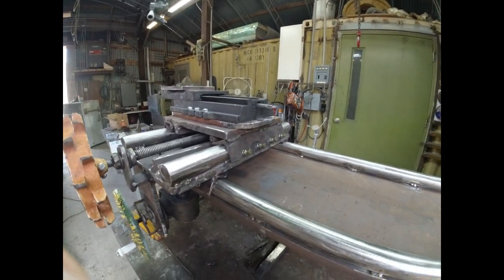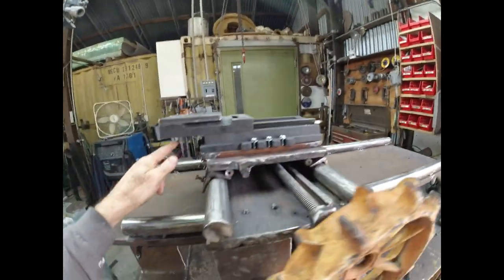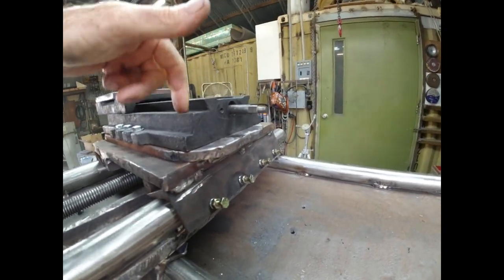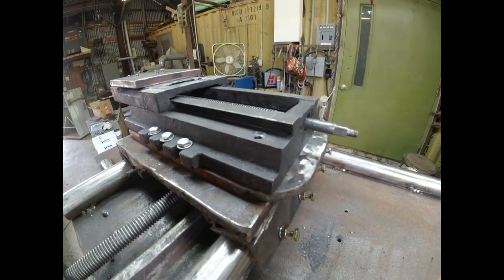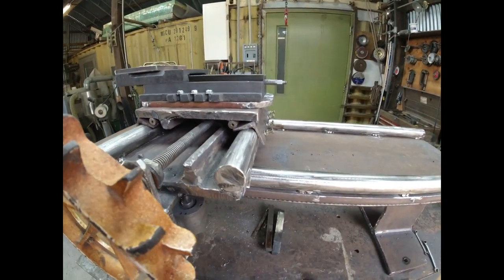Okay, today the stars and the moon are cooperating. I got seven bolts holding the cast iron to the steel. These two, I got some Yankee ones here. I want to replace them. That's a flathead, and they need to be a smaller flathead so that the carriage can slide over the top of it. So that's pretty much done.